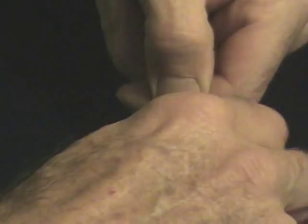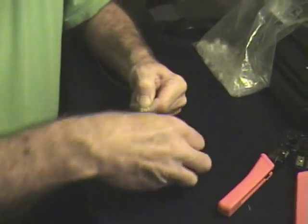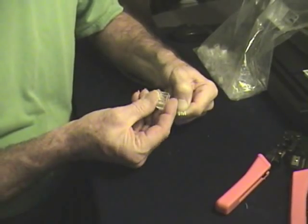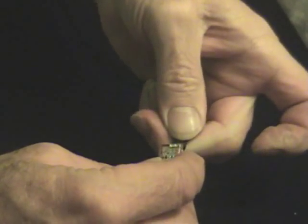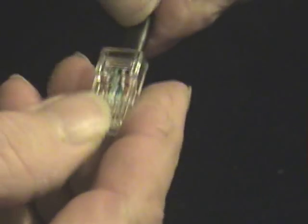Okay, double-checking. Take the cutting side of the crimping tool and make them all an even length. Then grab an RJ45 connector and slide these in to the little tunnels and furrows that you can see.